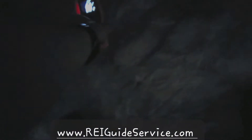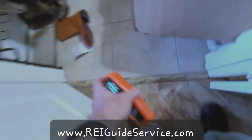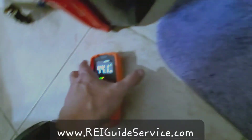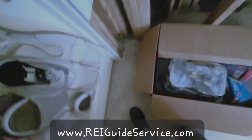This is the master. It's severely elevated — 22%, 18%, 17.7%. 29% on the tile. 52% in this area. 43% here. This is where the leak originated from. And as you can see, they didn't even bother to take that into the baseboards or anything else. Elevated — overloaded the machine there.